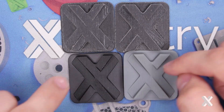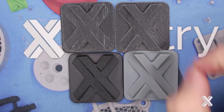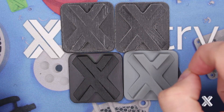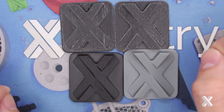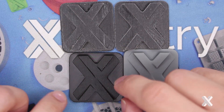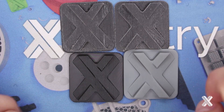So what's the difference? It all comes down to those mechanical properties. These Carbon materials can stretch at least 3x what the PolyJet materials can before breaking. When I talk to people about PolyJet, I usually say the end of life of a PolyJet material is that it tore on you — usually if I'm looking for these results, I'm already moving to a urethane cast. So now I can directly print a much more durable rubber-like material.